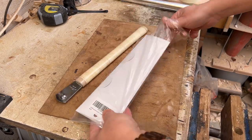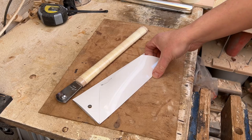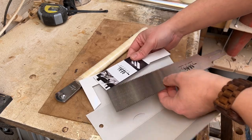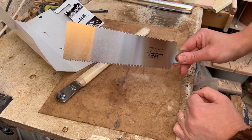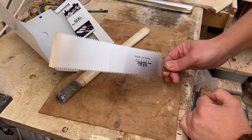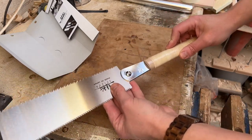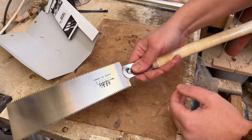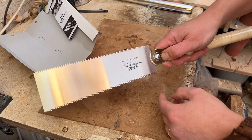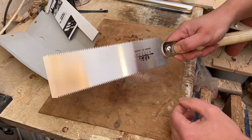I went on the internet shopping site — I'll put a link in the description — and I came up with one of these. This is brilliant because it's a two-for-one: it has two different cutting sides, a rip cut side and a cross cut side. At first you might think that's going to be all bendy, but because this works on the pull, even if it slackens off a little bit, as you pull it straight that tension is still there. It is quite a lot thinner than a standard Western style saw.